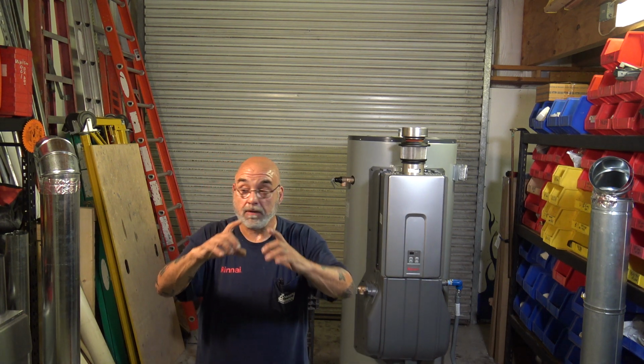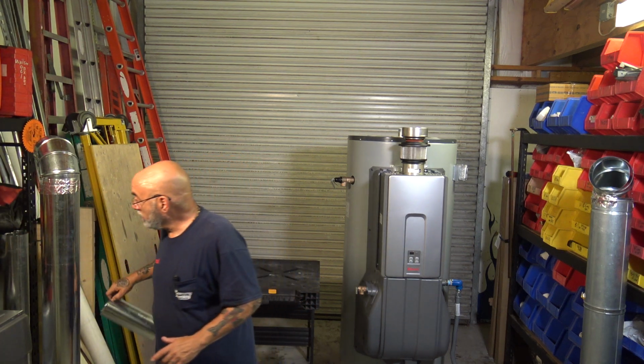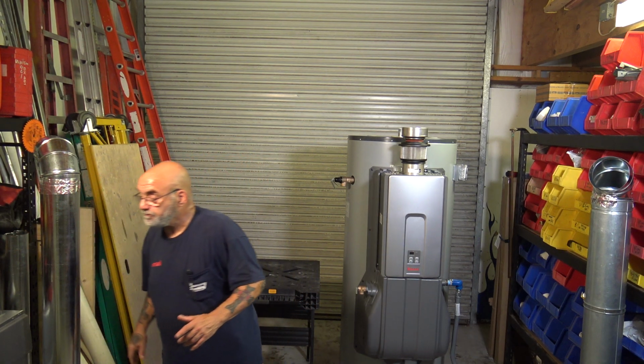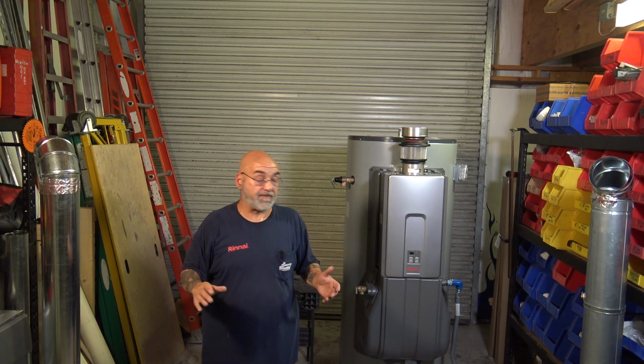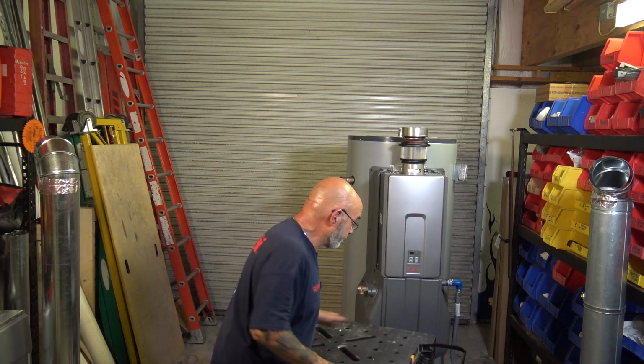So you gotta take out that old fitting. That 4 inch fitting, or that 5 inch fitting. You're gonna have to take that out, and you're gonna have to put in what they call a Y fitting. All right, so let's go with the Y.